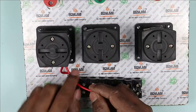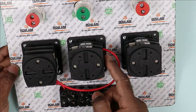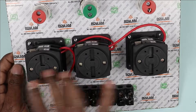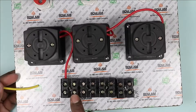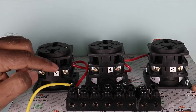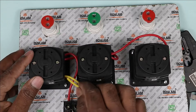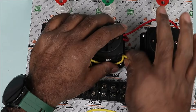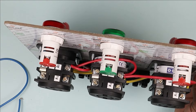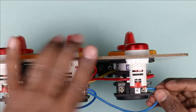I am using a wire and connecting it at this point. Now take the other end of this wire and connect it with the A1 terminal of another selector switch. Loop a wire again and provide R phase power supply to the third selector switch. So we provided R phase power supply to all the selector switches. Now on the second terminal, we have to connect a yellow wire for Y phase. I am connecting this wire with this point, and connecting Y phase power supply with the A2 terminal. I will do the connection of Y phase with all the remaining selector switches. Now take B phase power supply also and do the connection with all three selector switches — connecting B phase with the A3 terminal. So to all three selector switches, I am providing R, Y, B — all three phase power supplies.